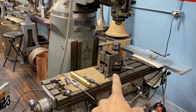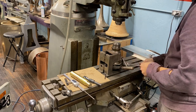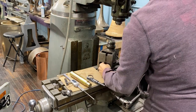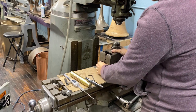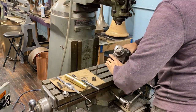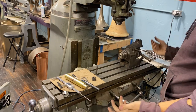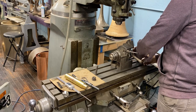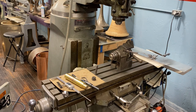So we are here at my milling machine. I have my indexer on its end right now, so I'm going to flip this guy around and try to get it set up horizontally. The tailstock's in the back room, so I have to go get that and figure out if it's the right height. It's kind of a shame to break this setup down — I paid Andrew to set this up when we were prototyping bottom bearings for rotor trumpets. This is the first time I've ever made a new piston casing, but these things aren't complicated — it's some holes in a piece of brass. There's no reason any repair tech could not gain the skills and machinery to do this kind of work, and there's a lot of demand for it.